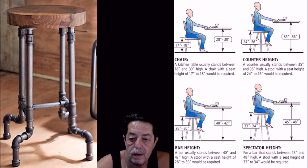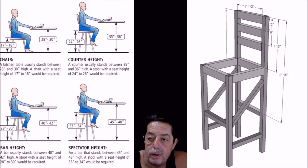This new picture gives you a boilerplate for the basics — dimensions to help you figure out how much steel to buy and how to approach the build, whether it's wrought iron, square tube steel, or whatever. On the back part this is where I get a lot of questions. Remember this shows it in a perfectly vertical fashion — you don't want it like that. You want the back tilted back just a little bit, so take that into consideration when fabricating.